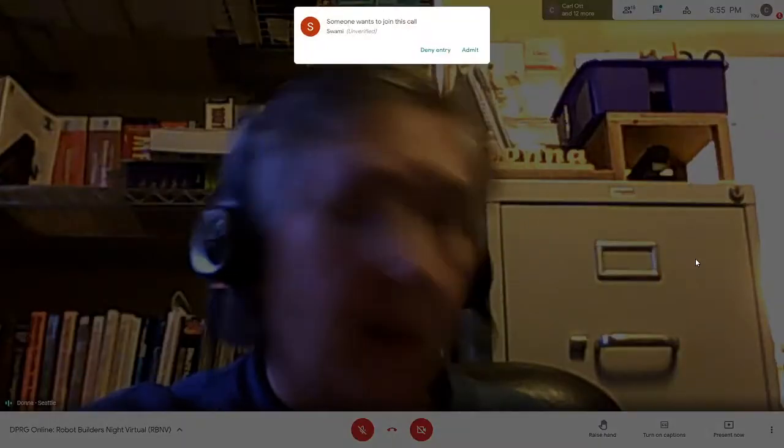In other words, having the Raspberry Pi on the robot itself, functioning as a web server, and also providing some GPIO interfacing, for this demo robot, that would then be reflected up on the web page, the website side, that's seen on the web browser. Okay, so that was kind of the way that I was positioning that.